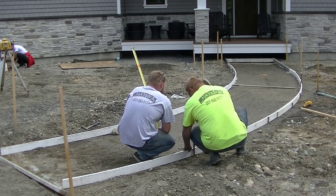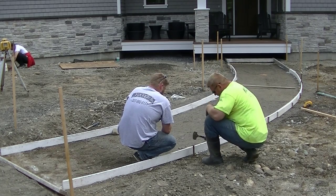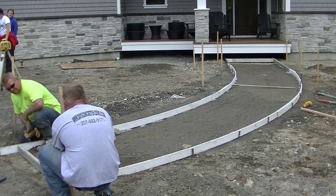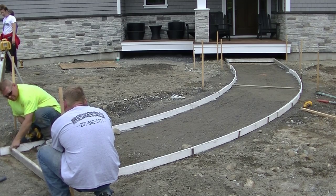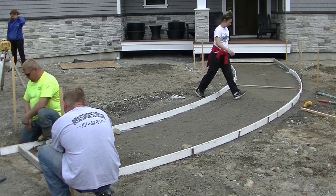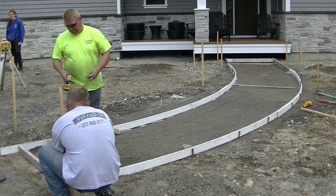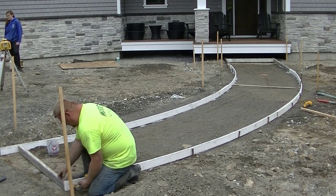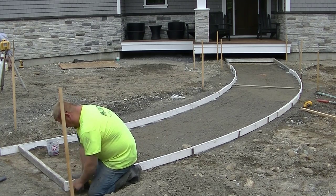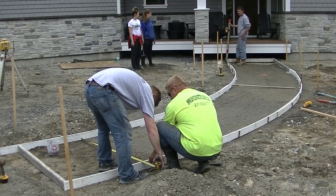I've had that laser for quite a while — if you've watched any of my other videos you've seen it. I've used Topcon lasers for about 30 years now and they're top quality laser levels. All the tools we use are linked down in the description so you can check them out. Now what we're doing is lining up that end board to what we think the edge of the driveway might be, because he's going to end up paving the driveway. So we want that form to be a little higher than the dirt and at about the right angle for the driveway to come into — otherwise it could look funny as you're driving or walking down the driveway.